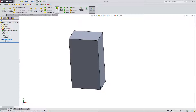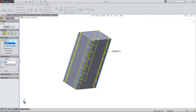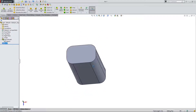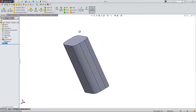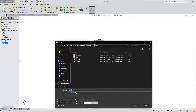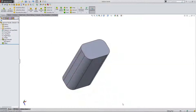As I mentioned, I'm going to click on fillet and add a fillet to the size it needs to be. This fillet is to be 0.175, which is what we set in the cutout of the hammer. It's a very simple shape but this is the inside cutout, if you will. I'm just going to save this part and call it 'hammer handle.'